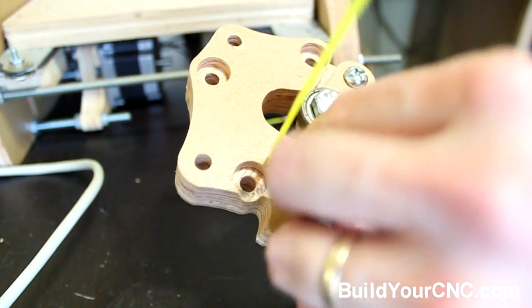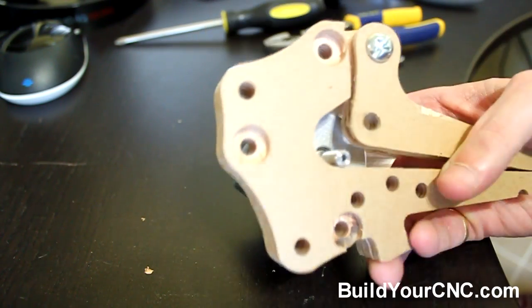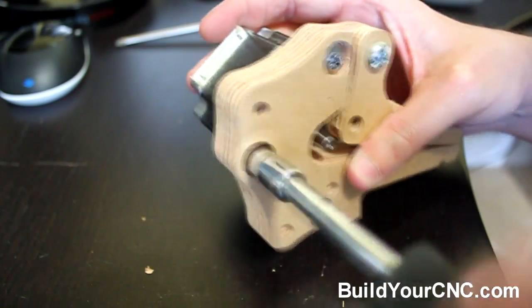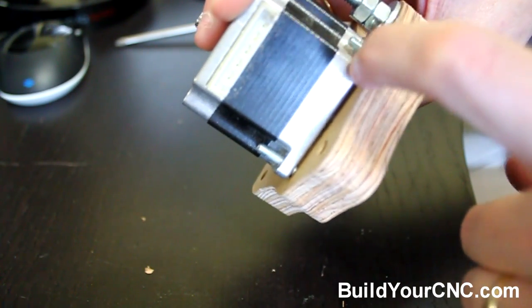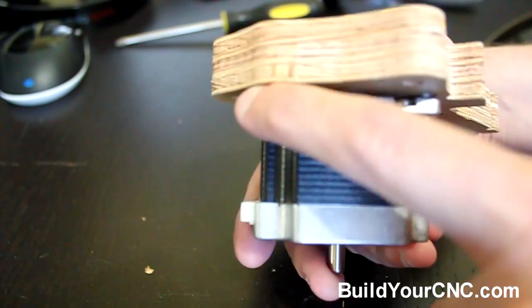Prior to adding the motor, we'll want to add a plastic tie into these two holes that will be holding the extruder assembly — the hot end. You'll need to align this hole, this hole, and the one in the back with these three holes here, and we're going to be using these washers and these screws. You want to try to tighten it evenly all the way around, because there's going to be a little space around the edge since there's a lip on the front of the stepping motor. You can also put washers in this space.